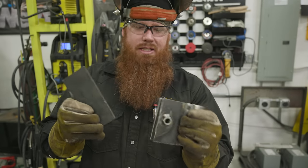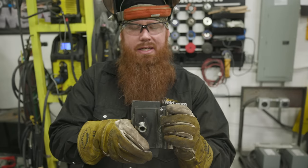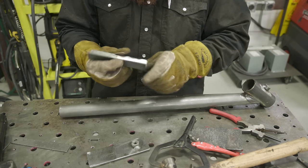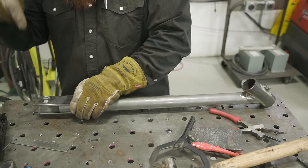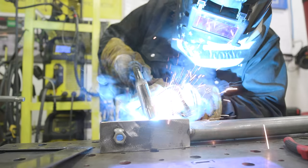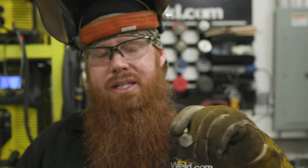Because we put the shim in there initially, now a three-eighths plate will go in nice and easy - I don't have to wedge it or beat it in. If I had just used the three-eighths plate with no shim, it'd be hard to get the piece in and out. Moving on to the 45 degree fixture - I've got a piece of one-by-one angle I'll lay in here, tack and weld it out, and then that plate goes on top and grabs the piece of pipe so I don't have to keep tacking pipe to plate and breaking it off. For the T-handles, I went ahead and took the coating off the tops of the bolts to avoid contamination and the risk of porosity.